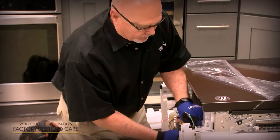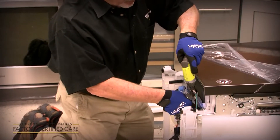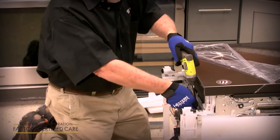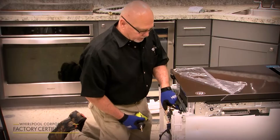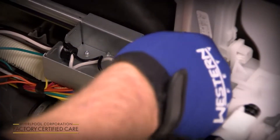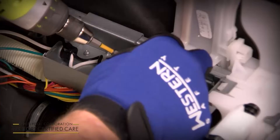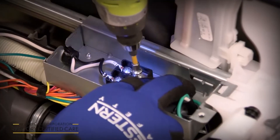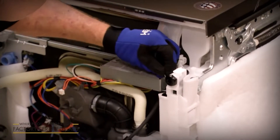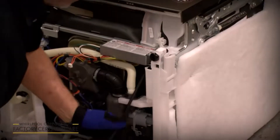Once you get the strain relief and the nut on it, pull the green ground screw out and put it through the green ground wire eyelet. We've got the ground hooked up with the quarter-inch green ground screw and green wire. Now pull the Phillips head screw out and go black to black and white to white, putting the screws through the eyelets. This is new — in the past we've always had wire nuts; in 2020 we're switching to this new terminal box. Reinstall the junction box cover.